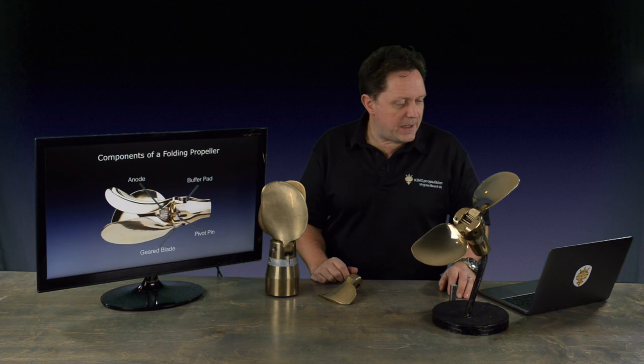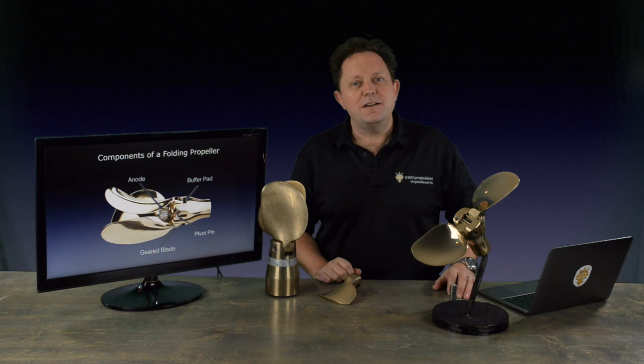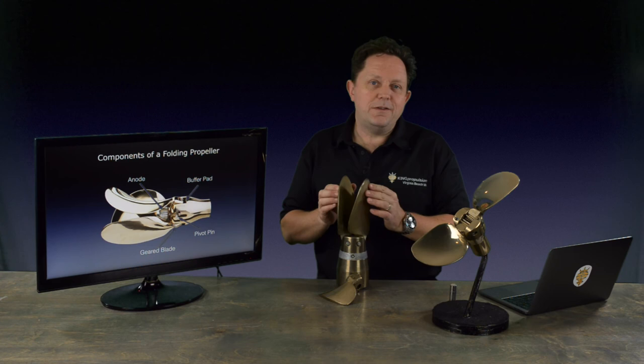The main components of a folding sailboat propeller are a little bit different to that of a fixed pitch. Fixed pitch everyone knows with its strengths and weaknesses, and the idea behind a sailboat propeller is that when you're sailing, the propeller is actually a drag and it's slowing you down. So it's an effort by engineers to try and solve these problems and make the boat go faster. The general premise is that the blades just pivot about a point and when you're sailing they fold out of the way.